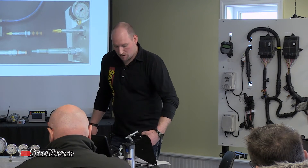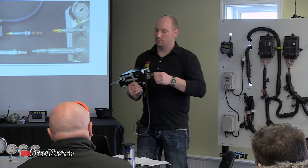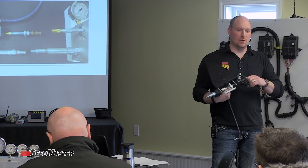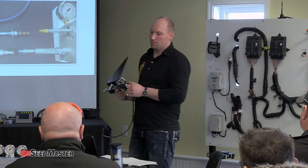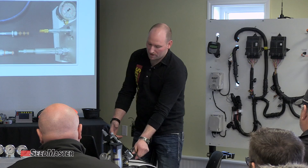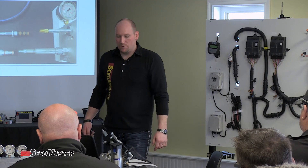That also gives us a point where I can show you that we looked at how to adjust the reliefs on these. There is an actual manual override for any valve that we can turn on and off for the most part. Should you want to be adjusting wing unfold pressure and you don't have someone to hold the switch, you can actually use a manual override here. Keep in mind that with all CT models or M-fold models, there are M-locks to stop the actual outer wings from pushing together. That's why we did main wings and then outer wings — because it stops the flow of oil from going out to the outer wings. The brass knobs are all manual overrides.